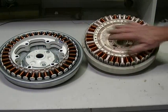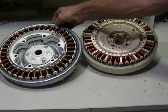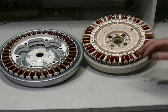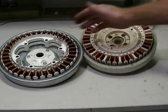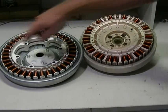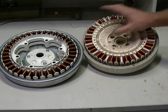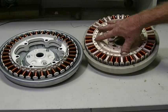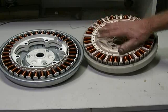This is the earlier one and this one here is the later one - you can see it's a little different. The later one is actually more suitable for our project than the earlier one. Both are the same motor, work on the same principle, both three phase. You'll see this one's a slightly bigger diameter. The wire is much thicker. These ones came out in four different models: they had the 100 series, 60 series, 40 series, and an 80 series as well.